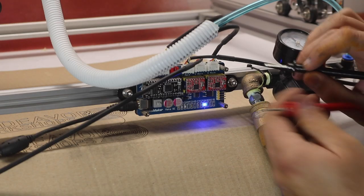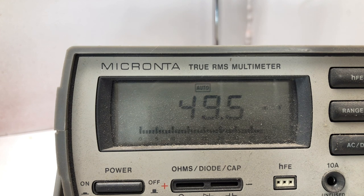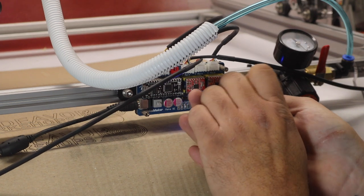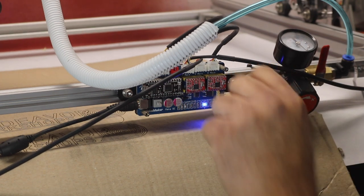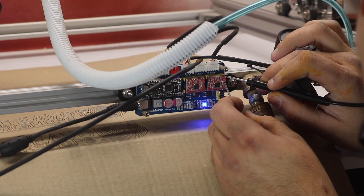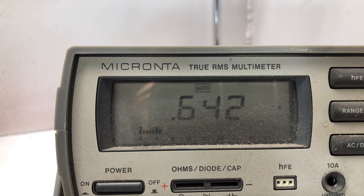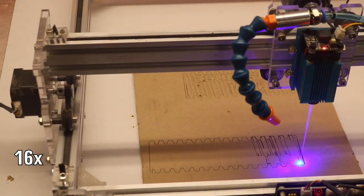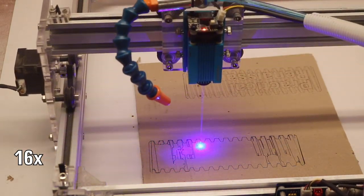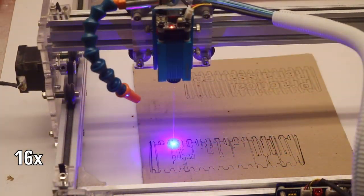The other thing I wanted to check was the output voltage of the stepper controllers on the Arduino board. Apparently this is variable, and sometimes it comes wrong, and it did on the x-axis here. It's only supposed to be 0.3 volts, and it was 0.5. I don't know how big of a deal this actually was, because I do know that stepper motors can get really finicky about all the electricity they're being sent, so I adjusted it down to a little bit closer to 0.3 volts, or 300 millivolts. If this was a contributing factor, great. We measured all of them and made sure they were as close as they should be regardless, and it seemed to help. I was getting a lot more accurate cut paths and didn't have any kind of missed lines or end points and start points that weren't lining up.